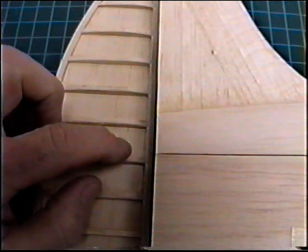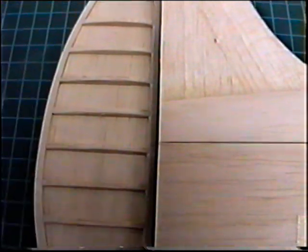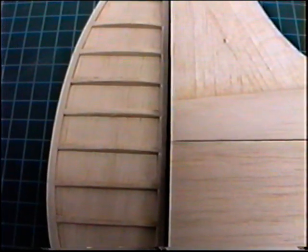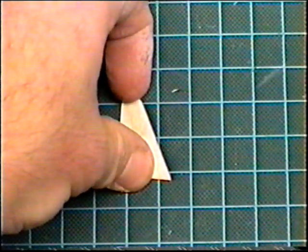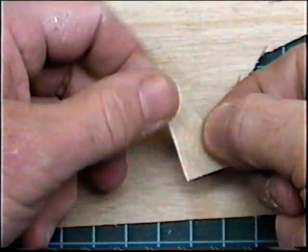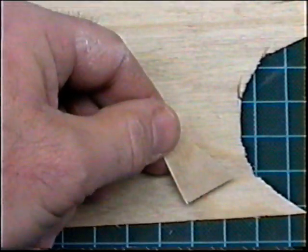So the first thing is to plot exactly where on here I want to have the horn, and then make it up out of laminated 64th plywood with the grain going cross grain. All that stuff is shown on the Spitfire plan. Another trick here is just cut one piece out, and each time you laminate it to the next piece of 64th plywood, move the grain in a different direction. Four pieces is enough.